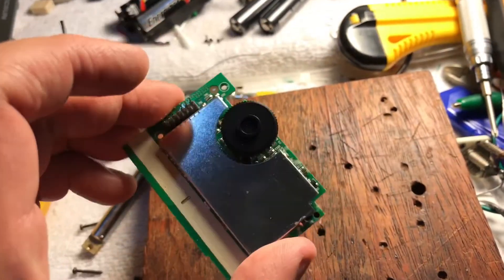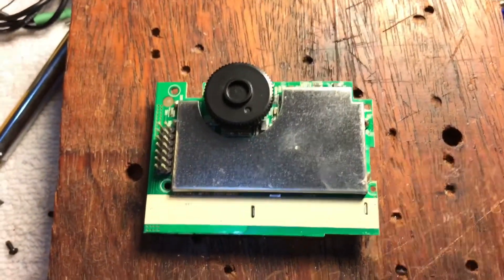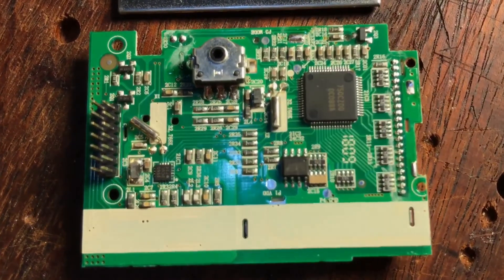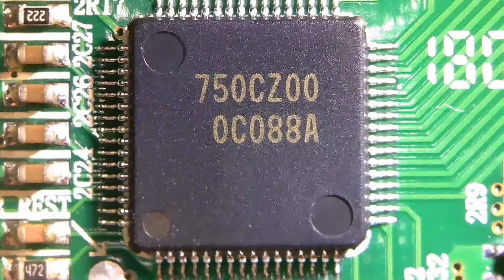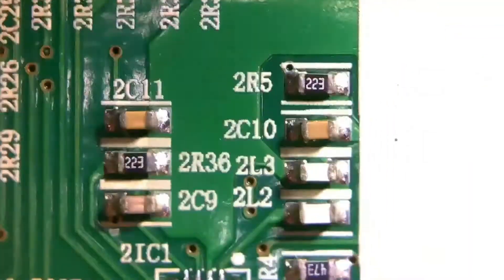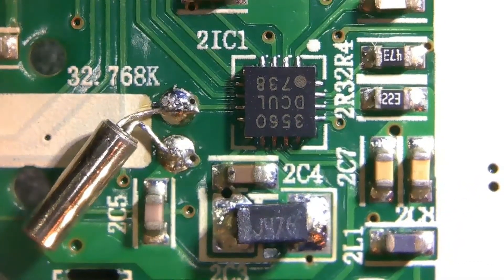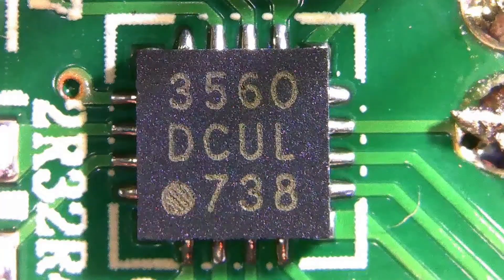All of the fun stuff is at the back of the display/button interface board, and it's nicely shielded there. I think this must be a rotary encoder. There are three significant chips on the board. Here's the mystery unidentified microcontroller, which will be controlling the display. We've got a crystal for the real-time clock there, a serial EEPROM, and the Silicon Labs radio IC. Note that it has a second crystal of the same frequency, which it uses as its time reference.